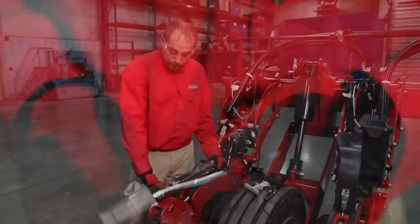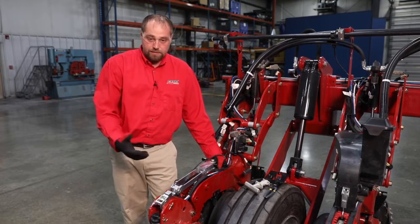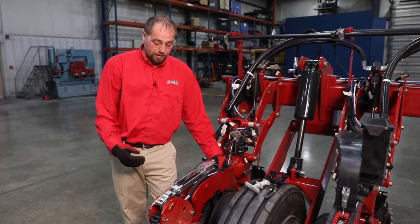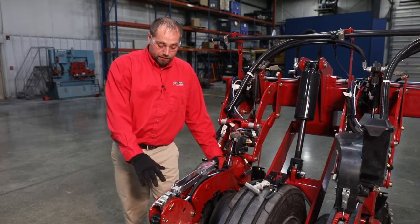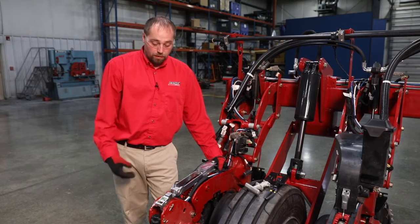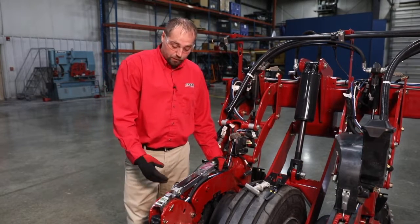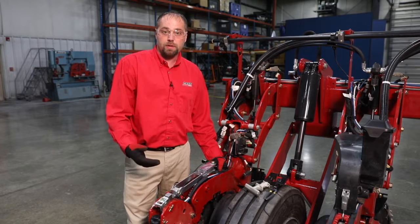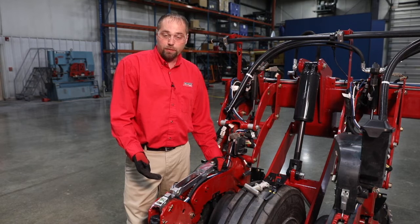that type of thing. The reason we'd be in here to look at the overall load cell is on our display, when we're looking at delta force or pneumatic down pressure, our load cell is not maintaining within 20 pounds of zero with the row unit up. Okay, so we'd go through the easy steps in the monitor, zero out all the load cells, and monitor it while we go through the field.